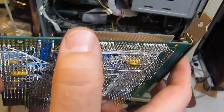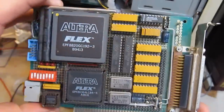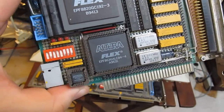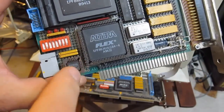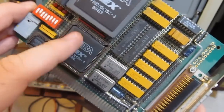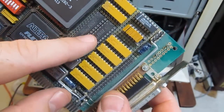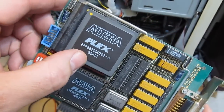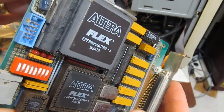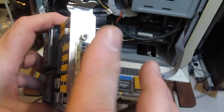You can see this is an old 8-bit ISA board. This is the second board I built, and you can see now all the decode logic has been moved down into this FPGA, and there is a ROM to boot this guy up. This board actually has the security key programmed up into this Altera device. You can see the addition of some static RAM and a slightly larger 8000 series part — this is an 8820 — and again a large 37-pin IO connector.